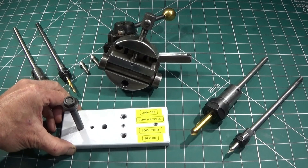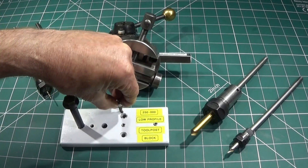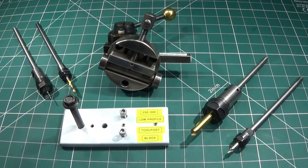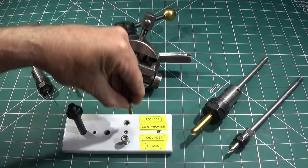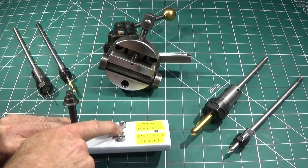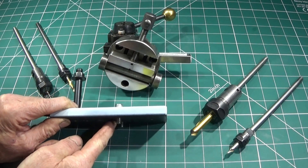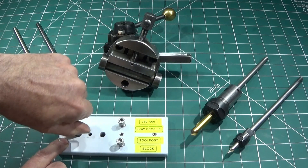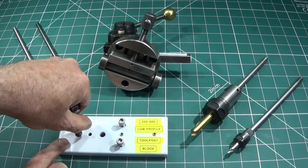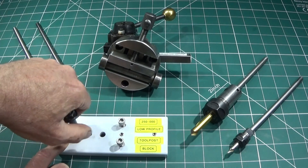All that you need to do with this plate is to drill three holes here for the Allen screws, and these screw into the compound slide disc. So it's just clearance holes for the 6 millimetre Allen screws, and then you drill a hole right through the center which locates on the lug on that disc. Then I simply drilled and tapped for a 10 millimetre studding which came with the Matchfit tool post, and all you need then is a tool post drill like I've made here.